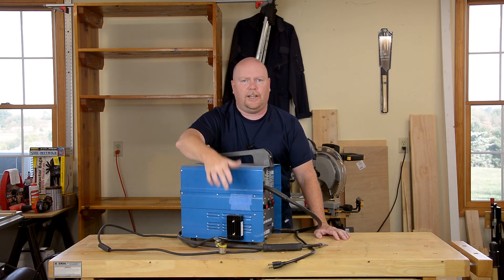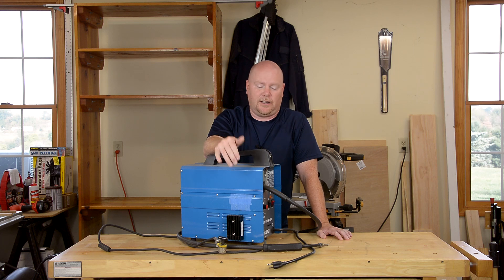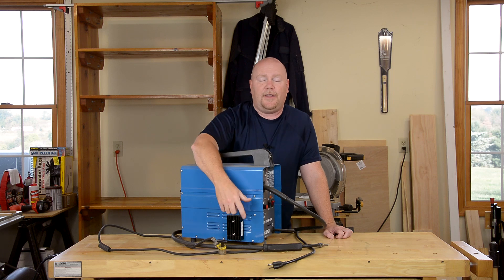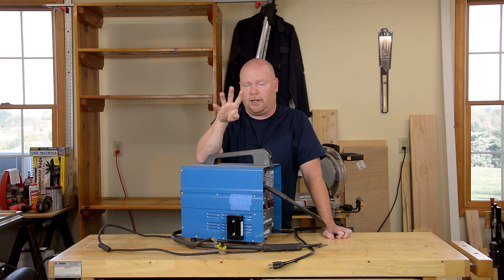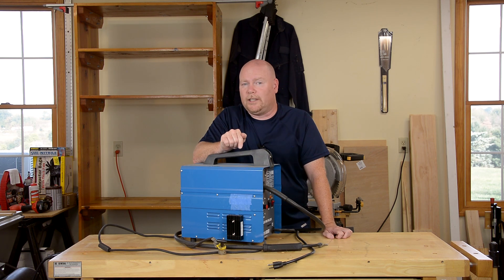The rectifier here is the most troubling thing for people. While the bridge rectifier is readily available on eBay and is still right around the $20 price range, you'll find that there are two flavors of it when you go looking online. The first flavor has a part number of QL 100A or 1000A. That's the one I have here — it's the single phase, meaning it only has four pins on it, 100 amp bridge rectifier. That one is what you see in the series and it's a straight drop-in.